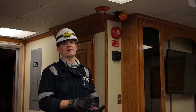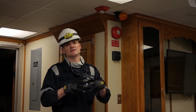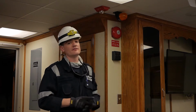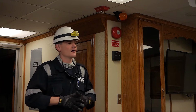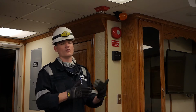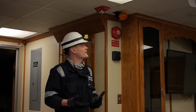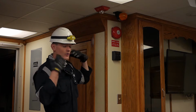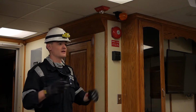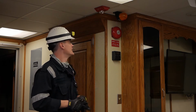So now that we've verified that the vessel's plans make sense with the arrangements, and that all the equipment itself is properly approved, we need to get into making sure that the system itself actually works. So while we're on board, we're going to want to see an operational test. Clear indicators of this working or not is obviously the noise. You'll be able to tell. You should be able to hear anywhere on this vessel that a fire alarm is going off.